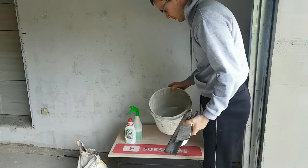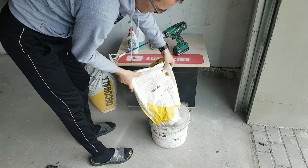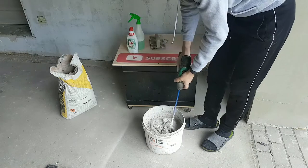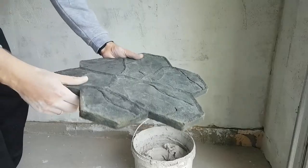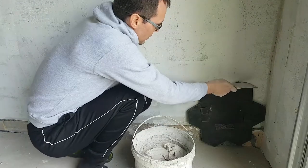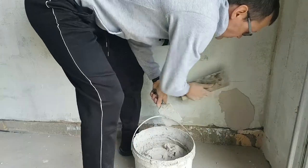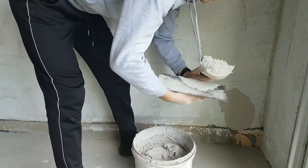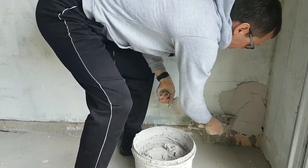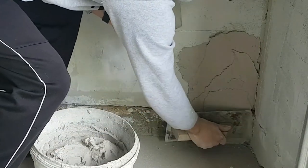We have some trowels and a bucket. We are preparing plaster now — mix it carefully and start the application from the corner. Just measure the aim of the first stamp and apply thickness according to the stamp used; in our case it's about one centimeter.